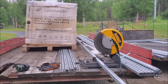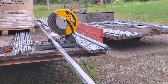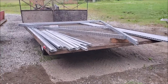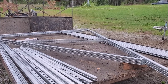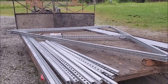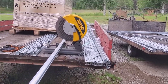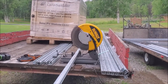I got a solar panel kit with a ground mount system that comes with a ton of unistrut and some cryptic drawings on how to do it. It's not too hard — basically you make big triangles and set it on the ground. I'm going to set it on pier blocks, pre-cut everything, then get the grandkids over to help put it together. I got 32 panels.